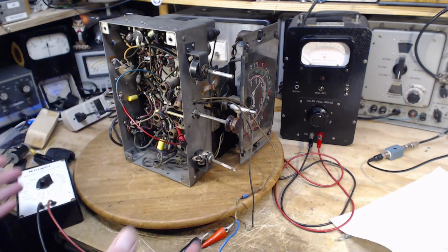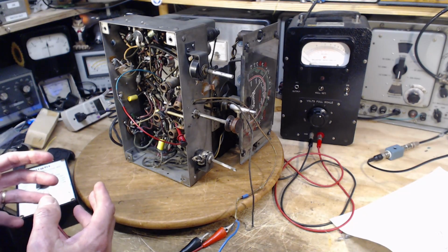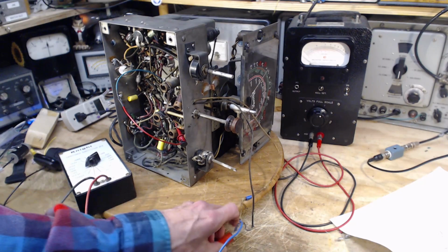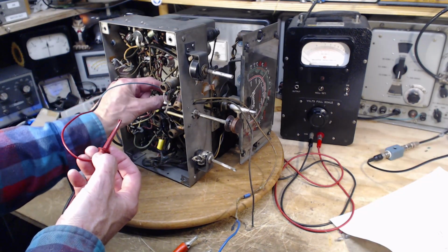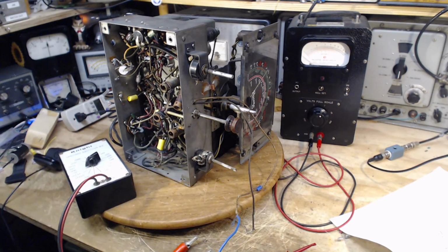We got a receiver that's really good at receiving the noise and has no particular, as I would guess, no particular resonance in the front end to help out. Now we'll try to see if we can make that happen by using this box here. Fat chance on this, but you know, this is where the fun is. So okay, disconnect this. You can see the radio went quiet because now it's got no antenna. This could be connected here at the antenna connection point. It's the same thing electrically.